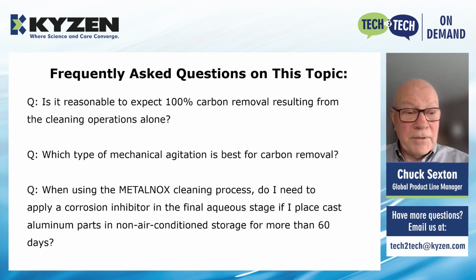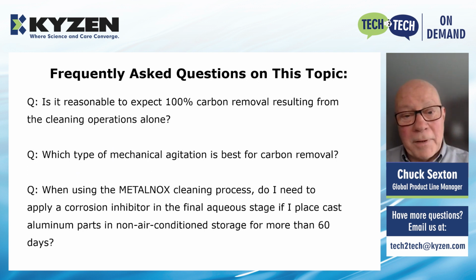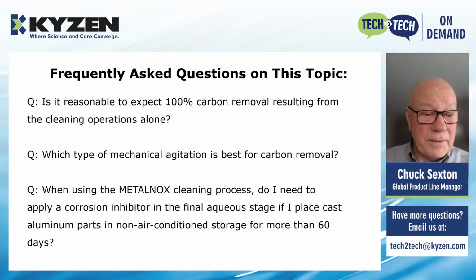Frequently asked questions on this topic, I put 3 together. Is it reasonable to expect 100% carbon removal resulting from the cleaning operations alone? The answer is no, it is not. However, we've improved the cleaning operation where the conventional process was getting maybe 80% off. We're getting more than 95% off, and that has greatly reduced the time required in the bead blast or sandblast process at the end.